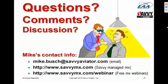Okay, Ralph says, I have just reached 500 hours on my mags. My mechanic said he will inspect the mags for wear. How long do mags normally last? My plane is a 1981 Piper Dakota. Mags normally last forever if you take them apart every 500 hours and replace anything that's getting worn out. The only thing that would prevent a mag from being reused is, well, if the case cracks, then it has to be rejected. There have been cases where something was damaged inside a mag, and a pole piece started rubbing on the rotating magnet assembly, and so the rotating magnet assembly was not reusable, and at that point it's not really economical to repair it anymore. You have to replace it. But generally speaking, unless something really ugly happens, you can keep a mag in service basically forever as long as you do a 500-hour IRAN.